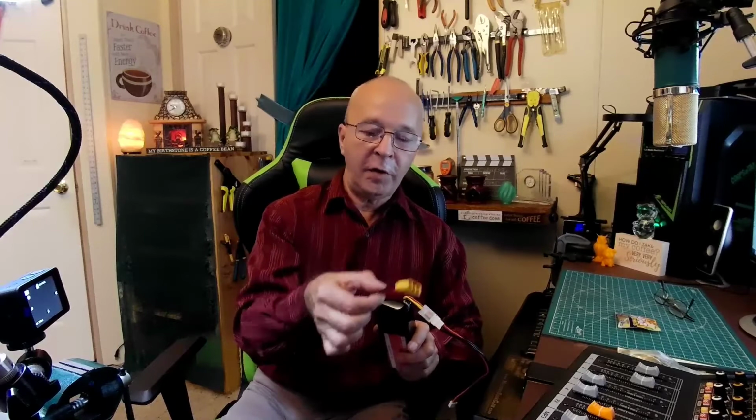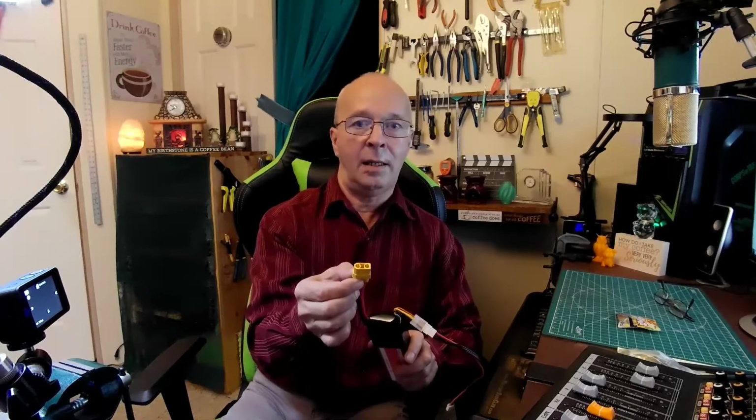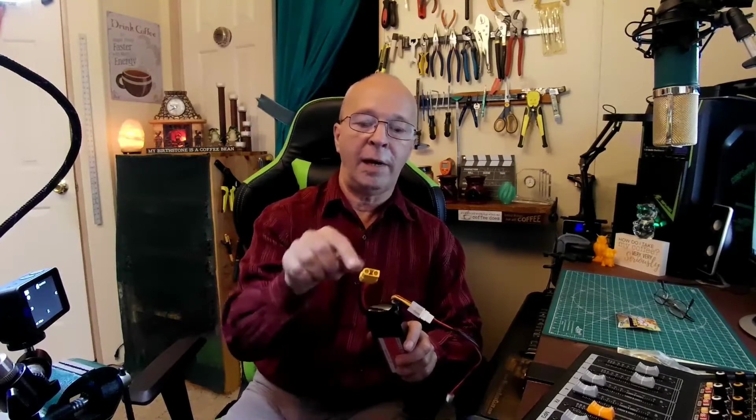Okay, but yeah, then put your heat shrink on there. And then do one side at a time. Put that protection on that. So when you do cut the other one off of the other plug, and you do bring it over, you don't accidentally touch this other wire to short the battery out. So yeah, use all precautions, especially when you're messing around with LiPo batteries.